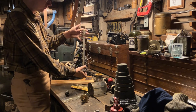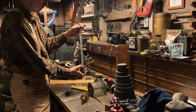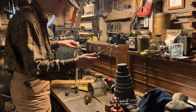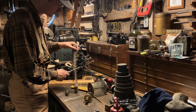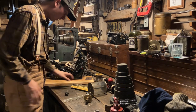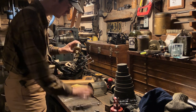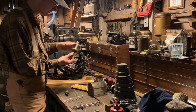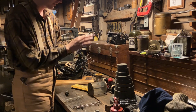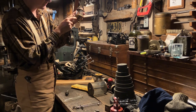They did have a little bit of protection in the form of these brass rods. The rod is supposed to start at the top and continue through these little retainers at the bottom. The gauge glass is a bit too long in this case, but say someone was swinging a screwdriver around and just about clipped it — it would hit the brass rod before it hit the glass, so it wasn't shattered. The job I have for this thing is to cut small sections of glass for drip oilers. This is an example of one I've tried it out on — the drip oiler off the seven and a half horsepower Fairbanks Morse gas engine from previous videos.